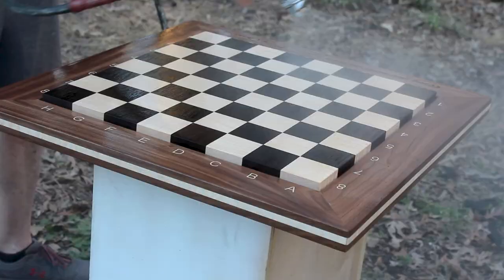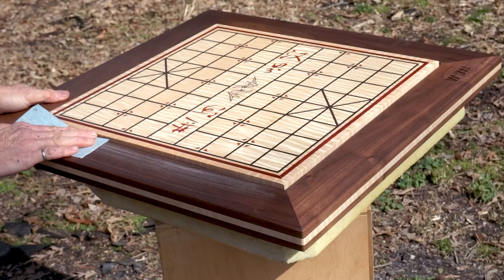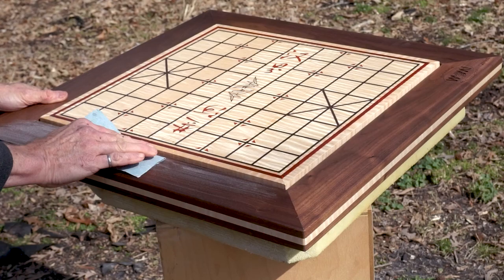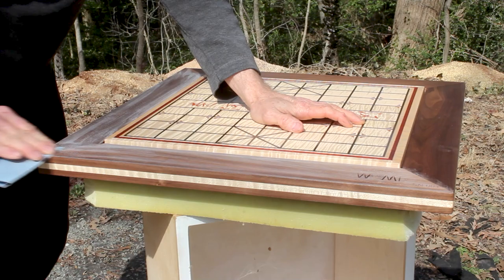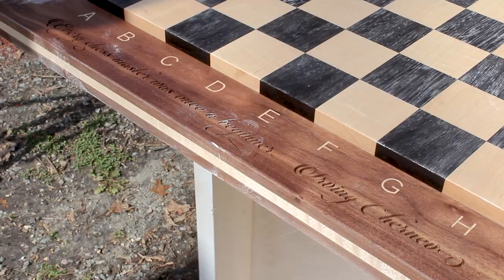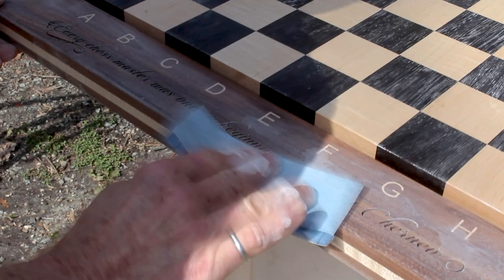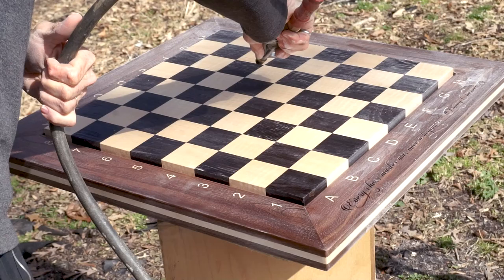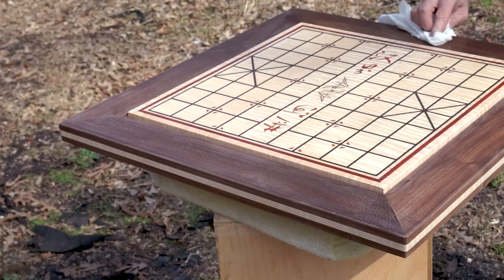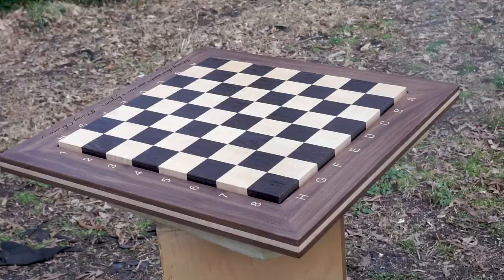One of the advantages of shellac is that it seals the wood grain, and it requires me to use far less lacquer. After the shellac is dried, then I will sand it with 320 grit sandpaper. And then I sprayed on 4 coats of pre-catalyzed lacquer.